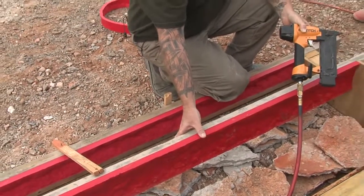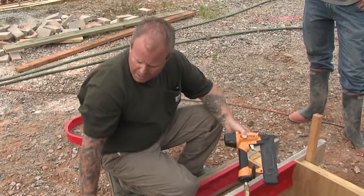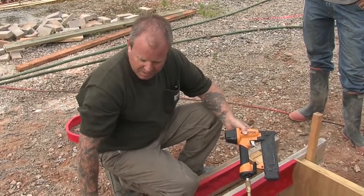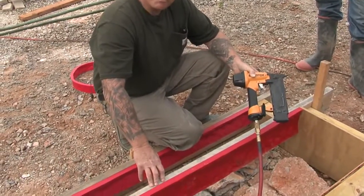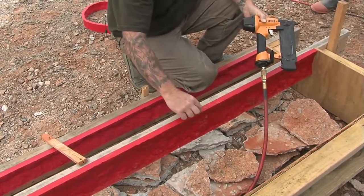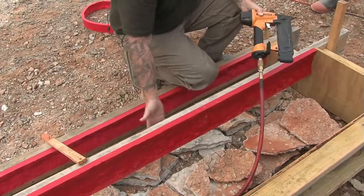I will have to strip this off during the pour, where the bottom stair riser can be left until the next day — there's no reason to strip that off. However, we need to strip this top one off during the pour simply because we need to finish underneath it and texture so we don't see that little bit of a gap left behind underneath the form.